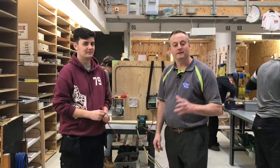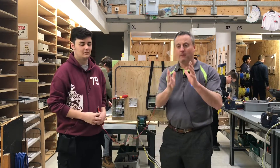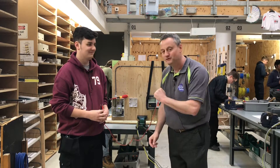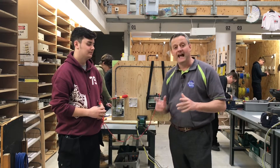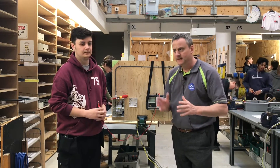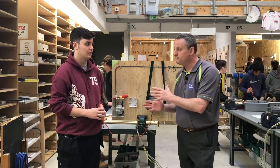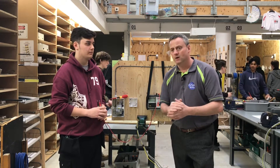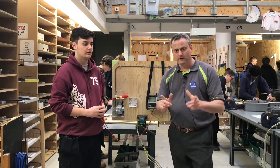I've moved around to Liam, who's about to perform a test. We know that 90% of knowledge comes from the questions, not necessarily the doing — so here are some quick-fire questions. Which test are you going to carry out? The insulation resistance test. Which voltage do you set the instrument to? 500 volts. Is that AC or DC? DC. We measure it in which SI unit? Mega ohms — mega standing for one million. The smallest acceptable value of insulation resistance is one mega ohm, and since this is a brand new installation, we expect it to be above 20 mega ohms.